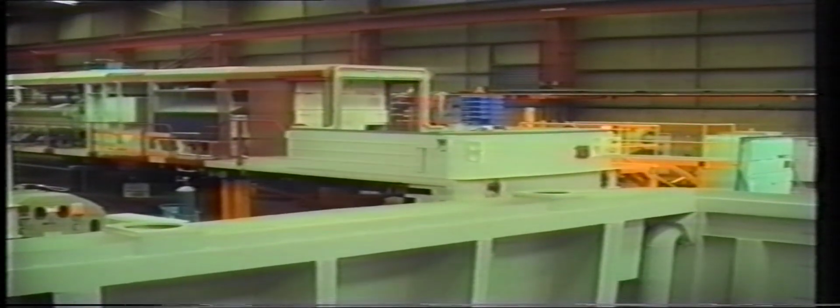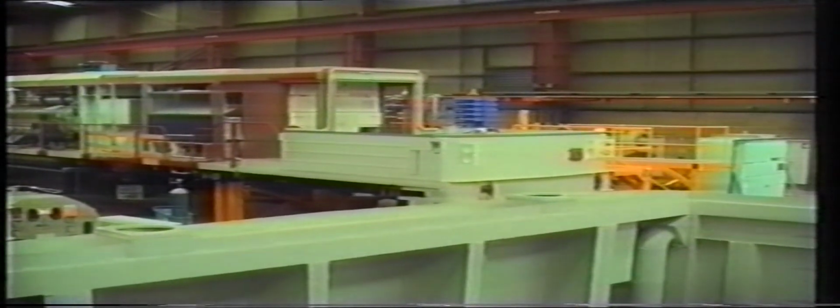Another feature of both the 82 and 90 class locomotives is the design of the isolated cabs. The cab assembly is supported by 4 resilient mounts. This helps reduce noise and vibration and demonstrates Clyde's commitment to crew safety and comfort. When at full production, there will be an 82 class delivered from Mittagong every week for over 1 year.